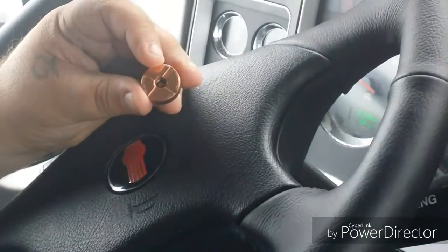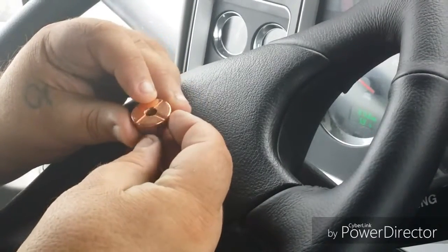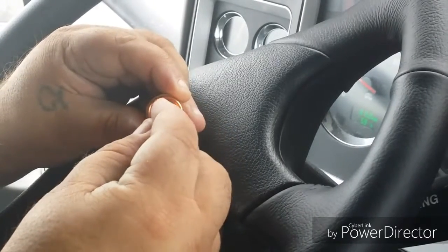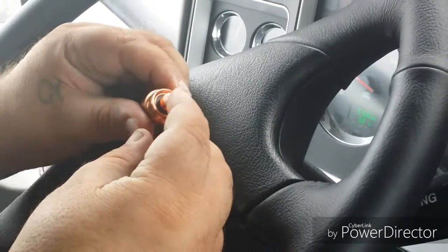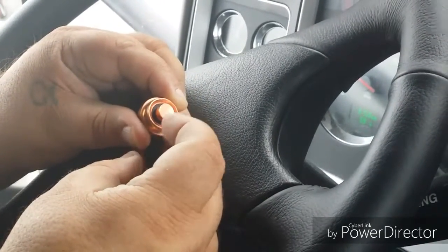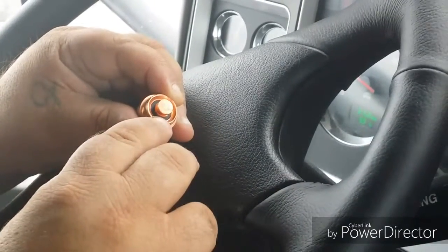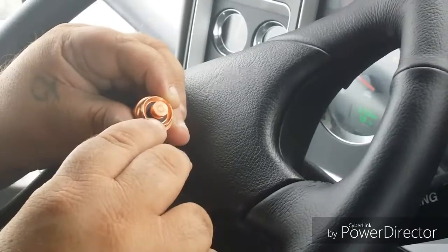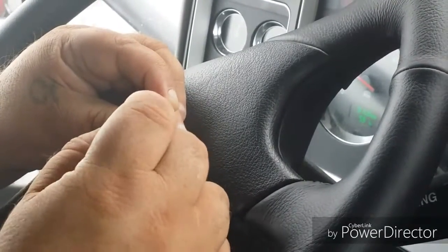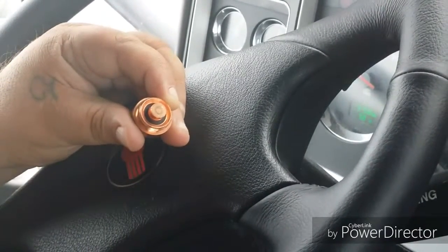Find a place to set the rest of this down. I'll show you this. Now this is an adjustable 510 connection. This is all copper. And you turn it over right here, you can see this outer pin right here. This is to adjust your battery rattle. You go left or right to adjust your battery rattle. Right behind it, there's a little screw nubbin thing, and that screws the 510 pin up and down, respectively, to adjust for your atomizer.